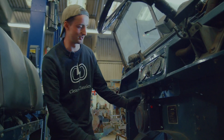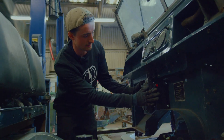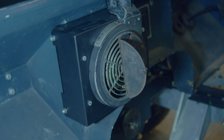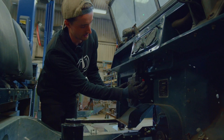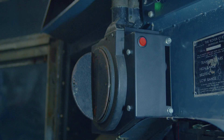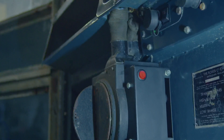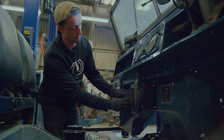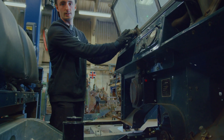This is the Smith's heater that we've shown you in development over the last few weeks — we've just put it in the Series 1. It's all powder coated and welded up with the original front panel on, about where it would sit in the original car. There's a little switch on the side for the heater element and a switch for the blower motor, as it was when this car got delivered to us. The flaps allow heat or air into the cabin, and when they're closed it goes up through these pipes to the windscreen as the de-misters.